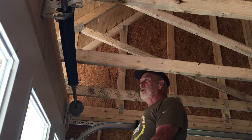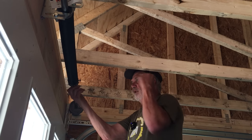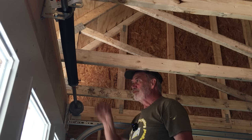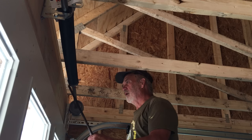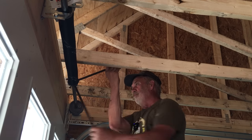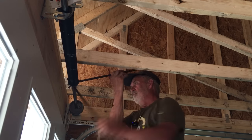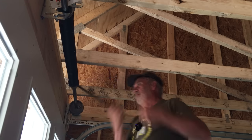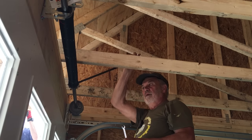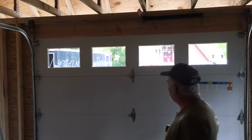So we're going seven and three quarters turns. Make sure these are all set, because when it's under tension you have to hold it with one hand and then tighten the screws with the other. It's all loose — here we go. And there's one. Okay, let's see if it works. That's a nine-by-seven all installed.